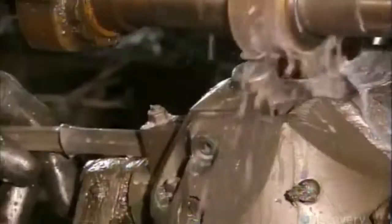A jagged cutting wheel carves ridges into the hammer's head. The device repositions the hammer so the wheel can cut it in a different direction, to create a grid. This surface is less likely to slip off nails on impact.